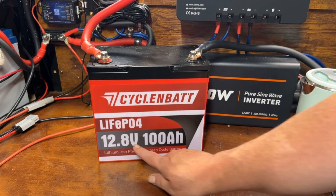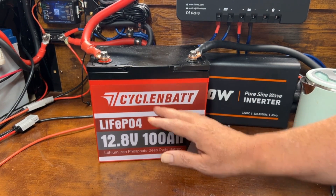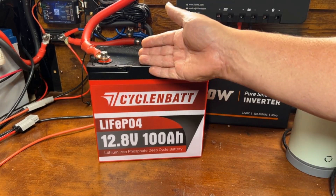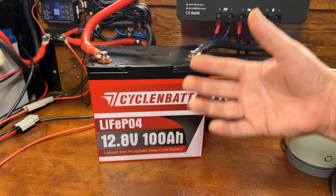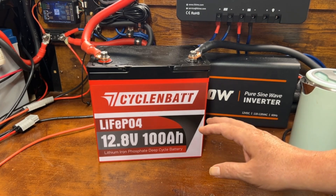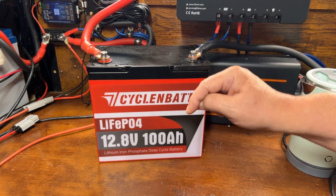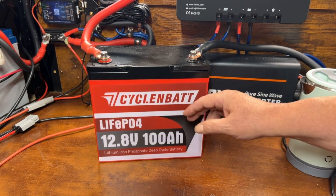This battery is 12.8 volts at 100 amp hours, which is equivalent to 1,280 watt hours. Eight percent of the battery was used, so I could have made that same breakfast about 11 times — not bad for a little 100 amp hour battery. What I'm going to do on this channel is more practical, real-world type applications to help people figure out what kind of wattage it takes for certain tasks. Whenever I review a battery that's been torn apart by someone else, I'll link that below — in this case, Brad Kegel, who verified the cold temperature protection works.